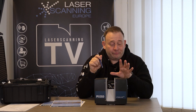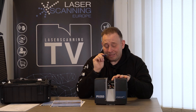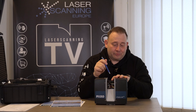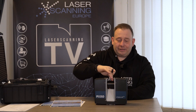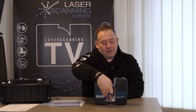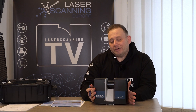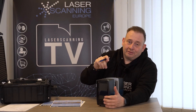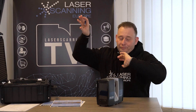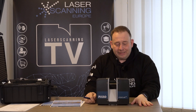This runs very fast. We can get a maximum of 80,000 measurements per second. That's a lot of measurements. As the mirror turns, we get a full laser beam sweep of 360 degrees, not capturing the housing of the system. Then we turn the whole system 360 degrees on its axis. This means we get a full dome view — a 3D panorama view of 360 degrees in all directions.